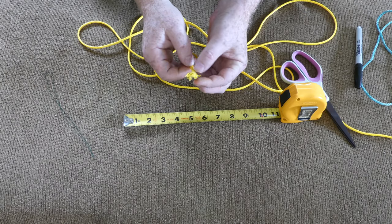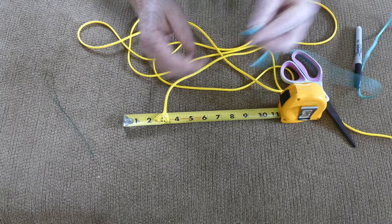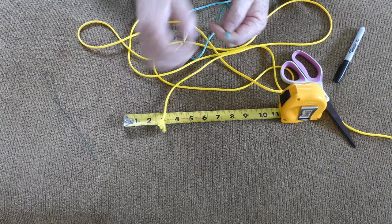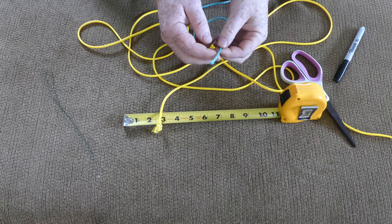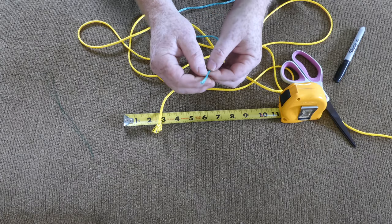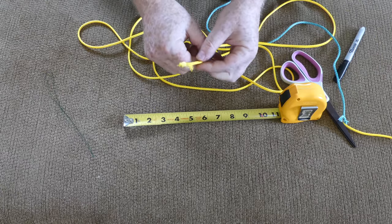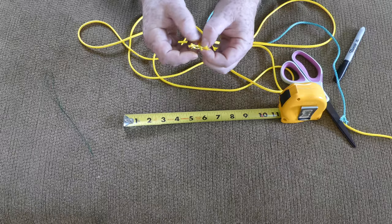What's kind of cool is that the 1/8" has more fibers in it and it's much stronger. The breaking strength of the 7/64" Amsteel is 1,600 pounds and it has eight strands when you pull it apart. The breaking strength of the 1/8" Amsteel is 2,500 pounds breaking strength.